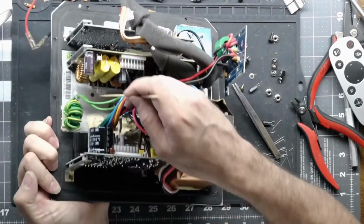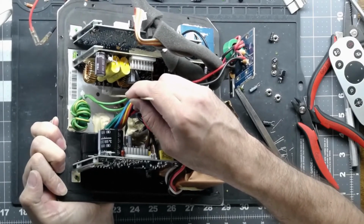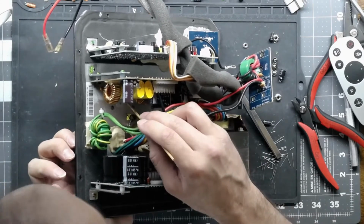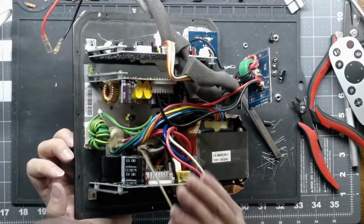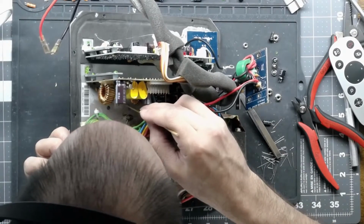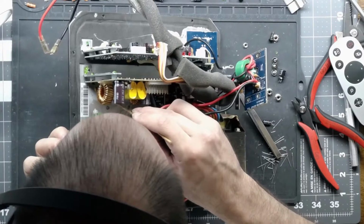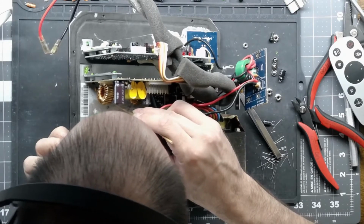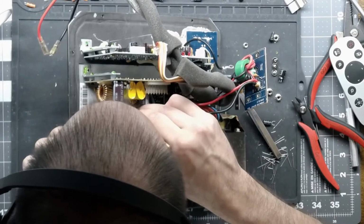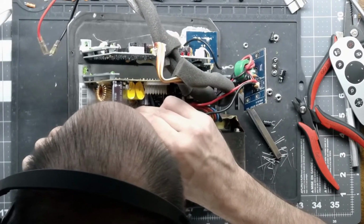You can't really see the device. You can see the device way down in there, but you got to make sure that you get this guy in straight and get him all the way down to the bottom of the device. Now, a lot of people will be tempted to bend the device up and off the plate. You don't want to do that, because then when you're moving the plate around trying to get the little clamp bracket to hold these things on, it's going to fall out of place. So this is where having a little bit of that thermal paste on the device helps.